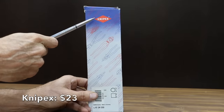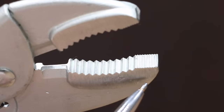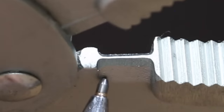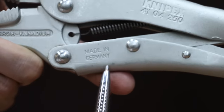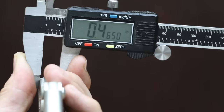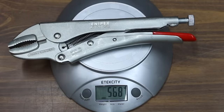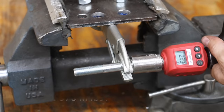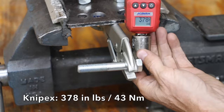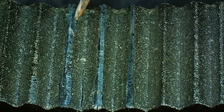At a price of $23 is the Knipex brand — the number one choice of tradesmen worldwide. Made of chrome vanadium, with a comfortable design and quality assured construction. The release lever is nice and tight, and the adjustment screw is nice and smooth. The Knipex brand is made in Germany. The jaw width is 0.46 inches and it weighs nearly as much as the Craftsman at 568 grams. The Knipex moved into fifth place at 378 inch pounds. Unfortunately the teeth just aren't very sharp and they experienced a little bit more wear than some of the other brands.